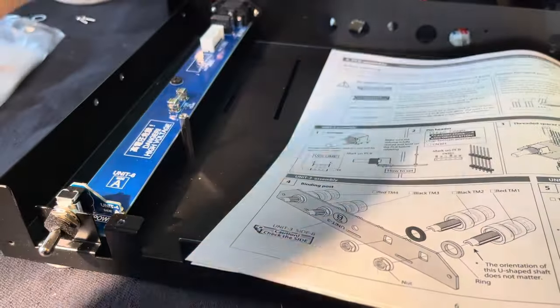That's the back deck. When you're done building the thing, you power it up. But if it doesn't work, there's a clever way to figure out what the problem is — they give you these voltage checkpoints. There are places on the circuit board where you can measure DC and AC voltages with a voltmeter.